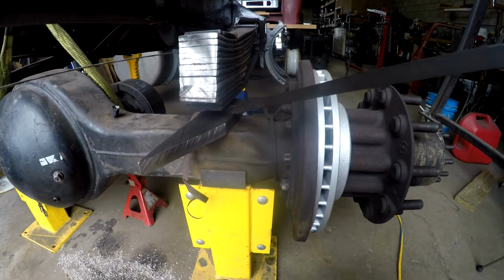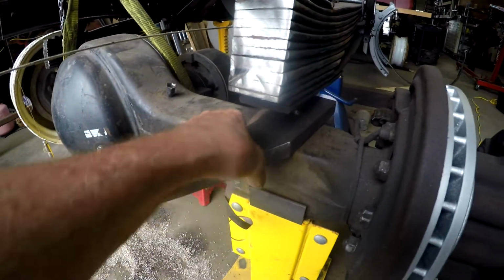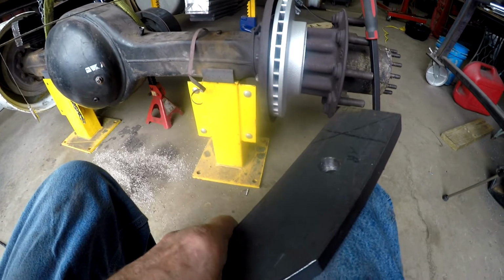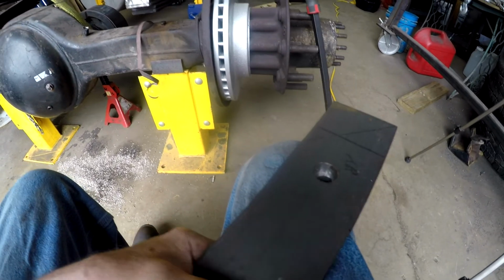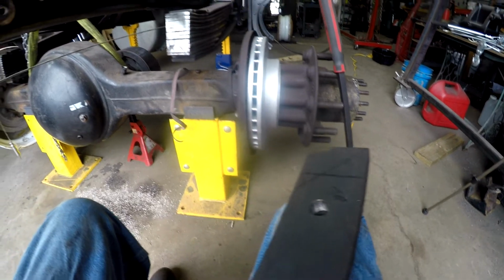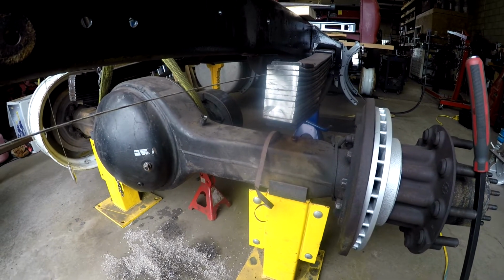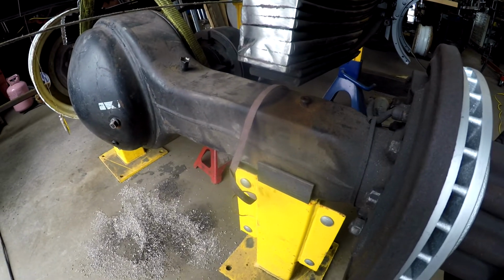well, milling it. Actually, there are holes for pins in the top of the axle. There's that pin, and there's also a pin on the bottom of the spring. So what I had to do is drill holes. I did it on the mill. They're slightly offset because that's the way the pins fall. The pins are slightly different, and this has been discussed in a previous haul truck episode about the pins in relationship to the axle. On the old axle, the pins were set back. As you see on this axle, the pins are set forward.